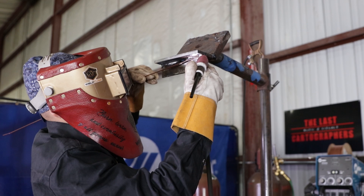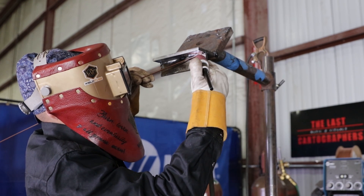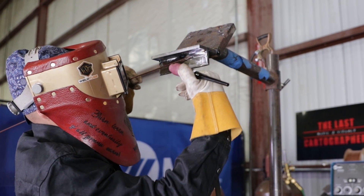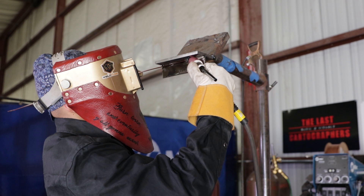I'm going to strike my arc. I'm going to freehand the first half because my cup can't essentially fit there, so I'm just going to freehand it, and once I get to a spot where my cup can fit inside that groove, then I'm going to wiggle it all the way. We're just going to go up and down running at 150 amps. It's going up and down real quick. You could freehand the whole thing, but I'm just going to a certain spot. You want to get used to freehanding and wiggling the cup. This is not walking, it's wiggling. I'm going to stop right here, readjust, strike my arc, warm it up real good, and then keep going.